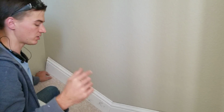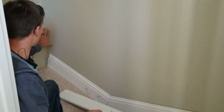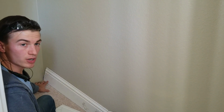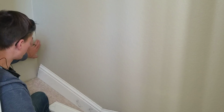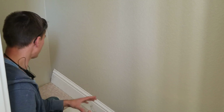If anything, rewind this video and rewatch it again. But it makes sense. Here we're going against 90. We're going against the wall. We're not going off a straight run. 90, and here we have 120. That's, again, 30 degrees difference. There we have 30 degrees difference, but that was from 180. Here we have 30 degrees difference, but it's from 90. What we do, again, is we split it in half, because we're going to do another turn. We split it in half, and we again get 15-15.